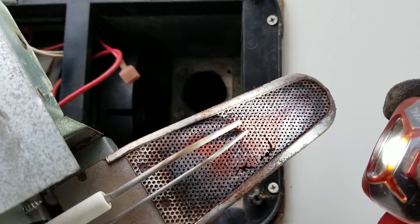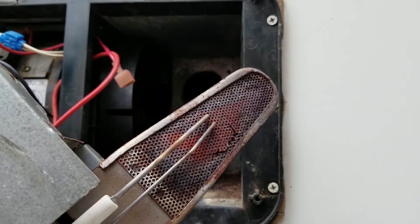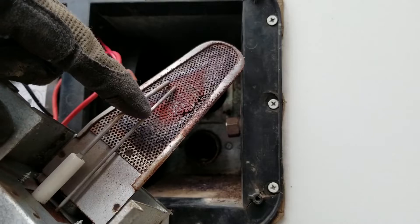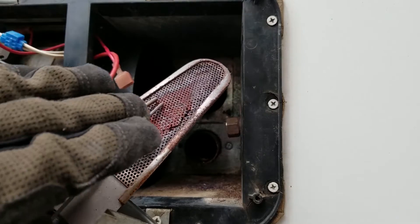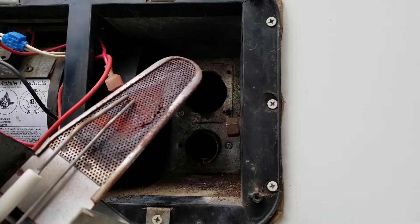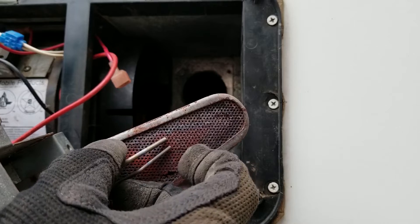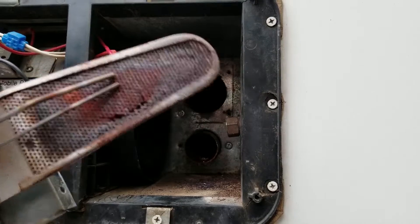So when I shoot my spark I need ignition, but the gas is escaping through that crack. At this point we need a new burner. This needs an eighth-of-an-inch gap between the two prongs and above the surface of the burner, but the burner has that crack in it. As gas comes in it's supposed to disperse nicely, but it's all coming out the cracked side. The intermittency may have been because there was a small gap there and now there's not. We need to replace this.